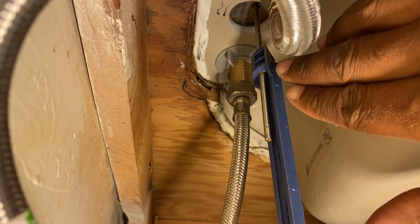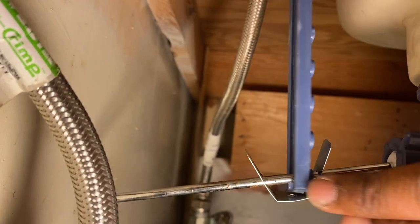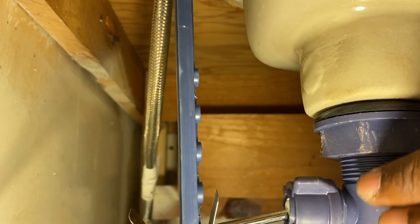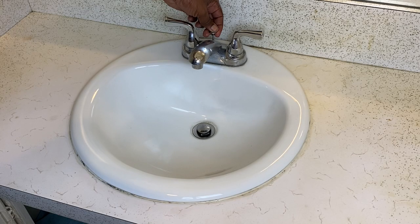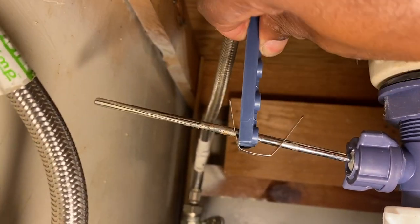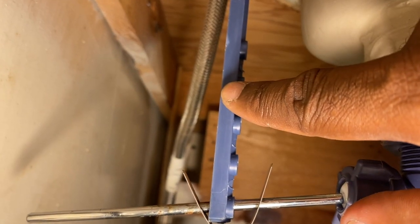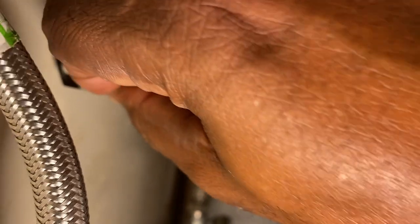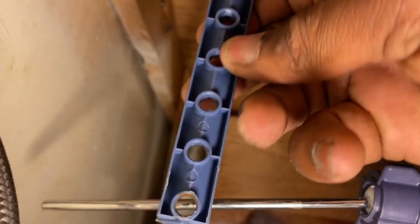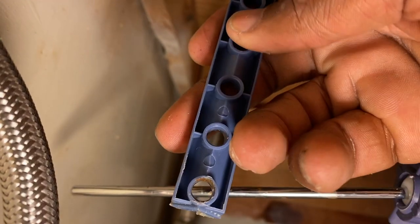The rod that you use to open and close your sink stopper — this is the bottom part of that rod, under the sink. That rod is connected to this plastic piece, which is connected to another rod, and it goes into this portion here and is connected to the sink stopper. So when you pull that rod up and down, it opens and closes the stopper. To remove the stopper, disconnect this rod from the plastic piece. Because the plastic piece is flexible, you can simply slide it off the rod. Note there are various holes on the plastic rod — remember where the rod was when you took it out so you can place it back in the same hole.